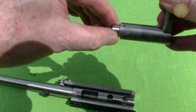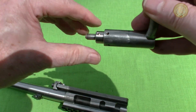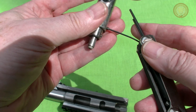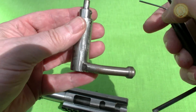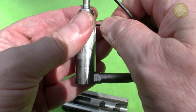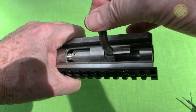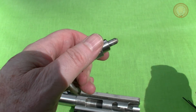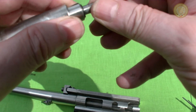The next step is adjusting the bolt insert for zero headspace. After adjusting, the insert is locked into place with a set screw. When properly adjusted, the bolt handle should meet just a little resistance as it closes. The O-ring, lightly lubricated with silicone grease, is slipped over the igniter and pressed into place. The igniter tip is then adjusted for the powder charge to be used and locked into place.